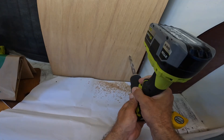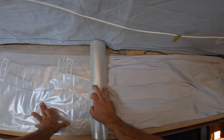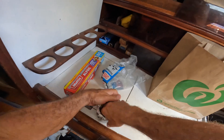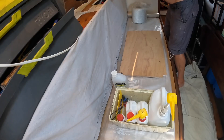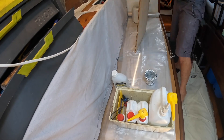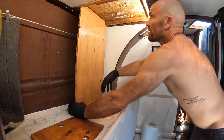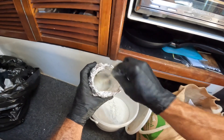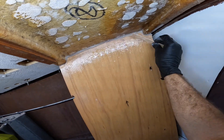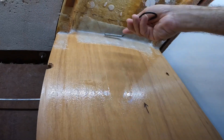After marking up and drilling the attachment holes, I prepped the surfaces that were going to receive epoxy and fiberglass. For these little mixing cups I like to use alfoil - double wrap it, and then once I'm done with that batch I can just pull the alfoil out, throw it in the bin, reuse the cup, and go again. Everything's done with these mixed ratio pump packs, so you just do one pump for both the hardener and the resin. Just remember when fiberglassing onto plywood, the plywood naturally absorbs some of the resin, so you need to apply a couple of coats until the plywood stops absorbing and is fully saturated - at that point you can start the fiberglass over the top, otherwise it's not going to adhere properly. Using thickened epoxy I applied a nice curved fillet to the hard edges so the fiberglass has a nice curved edge to adhere to. I used four sheets of 400 gram double bias - I think that will be plenty on both the top and the bottom.